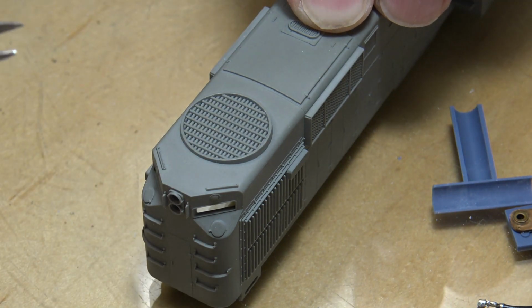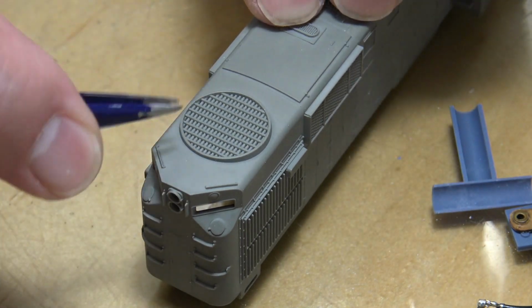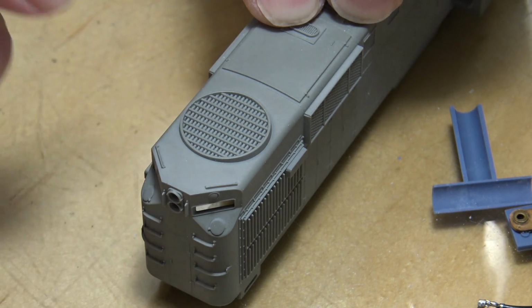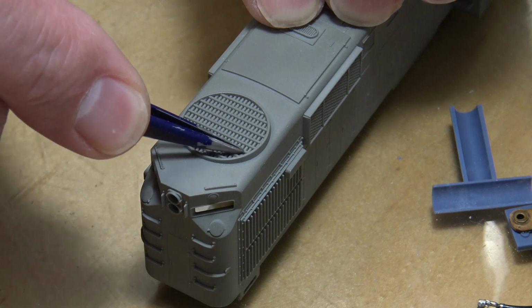And when you use a reamer, there's a chart on how much undersize your hole should be so that the reamer can precisely cut it. For this one, the hole should be undersized by anywhere from 1/64 to 1/32. So I'll cut this out at